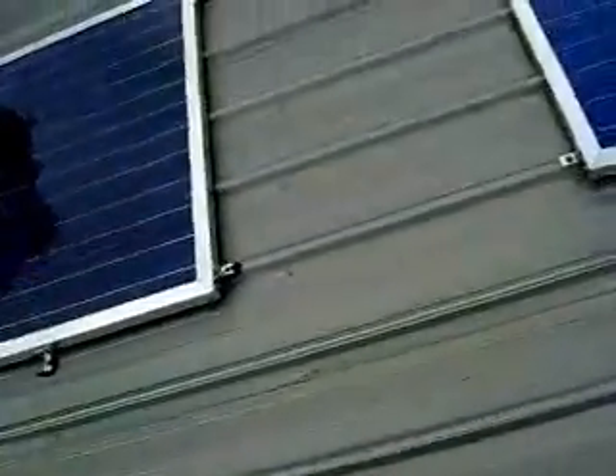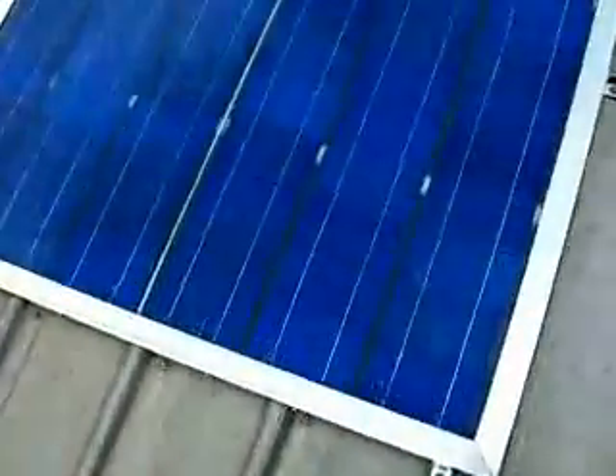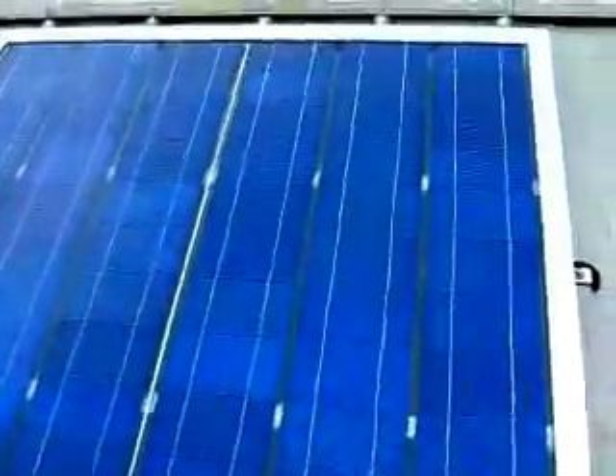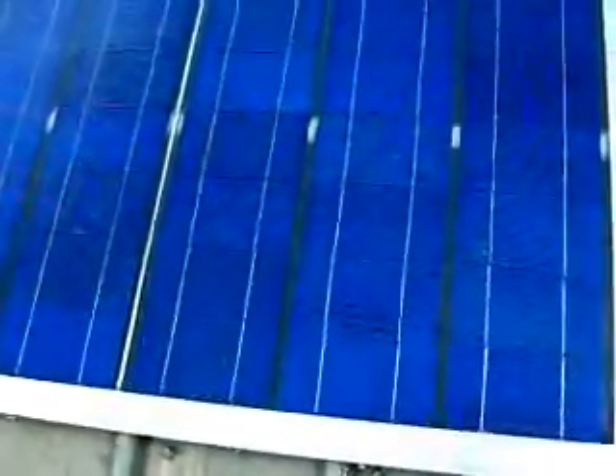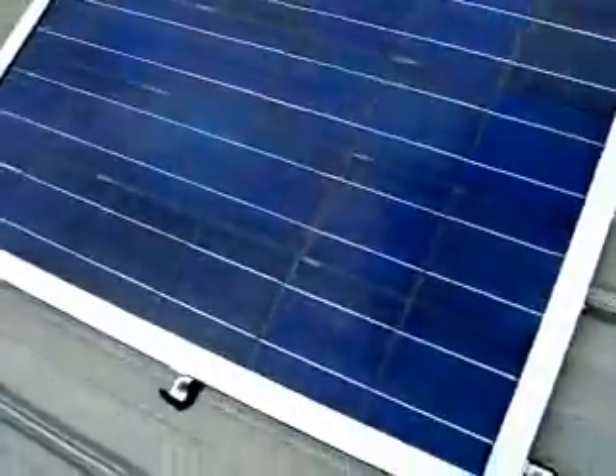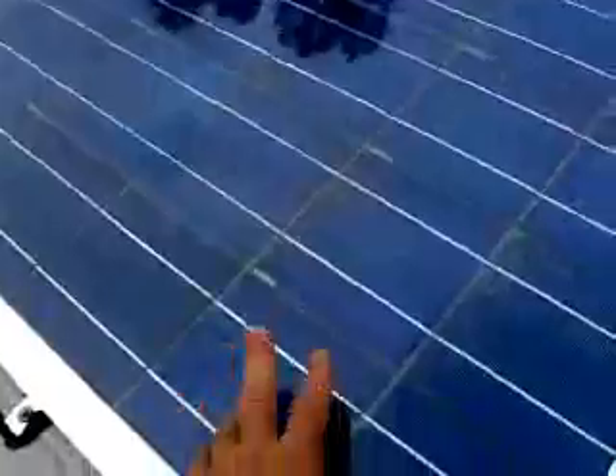It's all in your design of your panels. This one right here I made out of the half cells - only made one of them. There are 72 cells in there to put out basically the same thing as the 36 six-by-six cells. Same deal as the monos - this panel puts out almost a full amp less than these 36 polycrystalline cells.